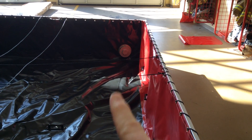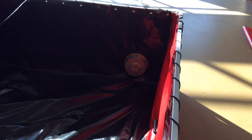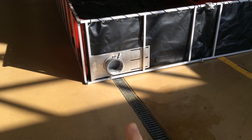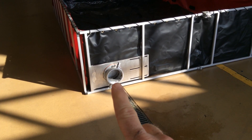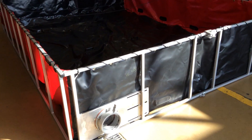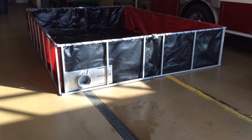We'll show some videos of that later. We're going to wait until the second tank and then show how that works. One of the choices for drafting is to hook up right to the through-the-wall connection, put your strainer on the inside right in here, and then draft. The advantage of that is that the suction hose is not up over top of the side of the tank.